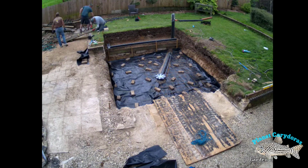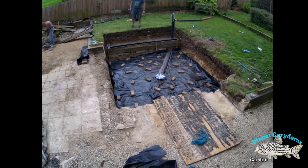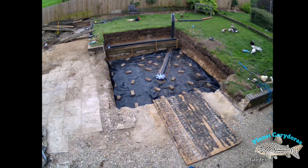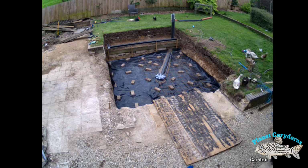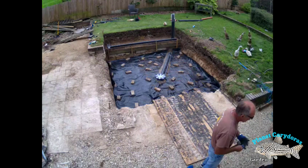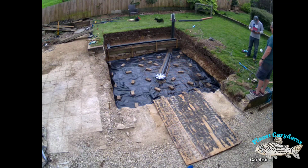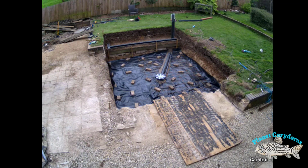This will stop that. And also, if you've got any water table problems, it should stop the water being pushed up as well. Rebar then goes in. The rebar goes in to help the concrete stop cracking itself. It gives it that much more strength, and you'll get that much more length of life out of your concrete as well, because there is going to be a huge amount of pressure on top of this concrete.